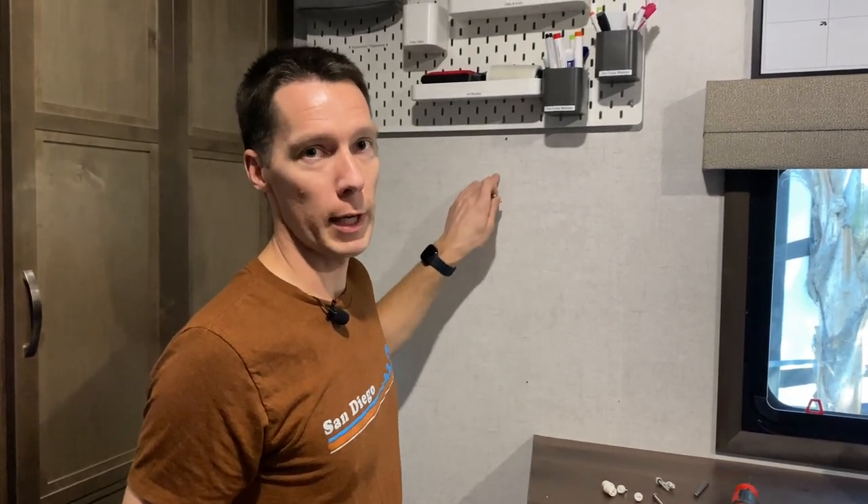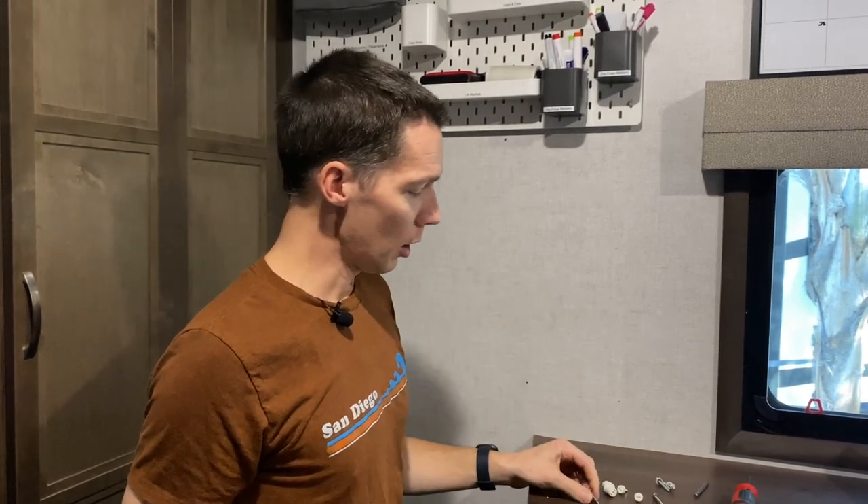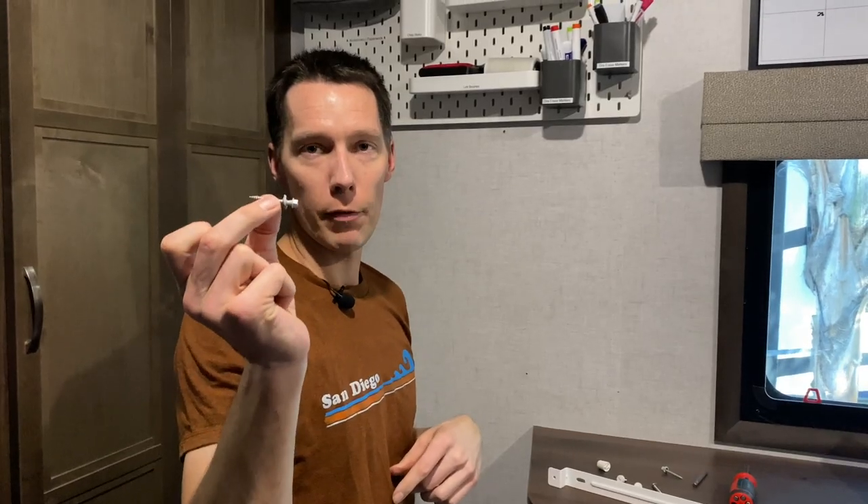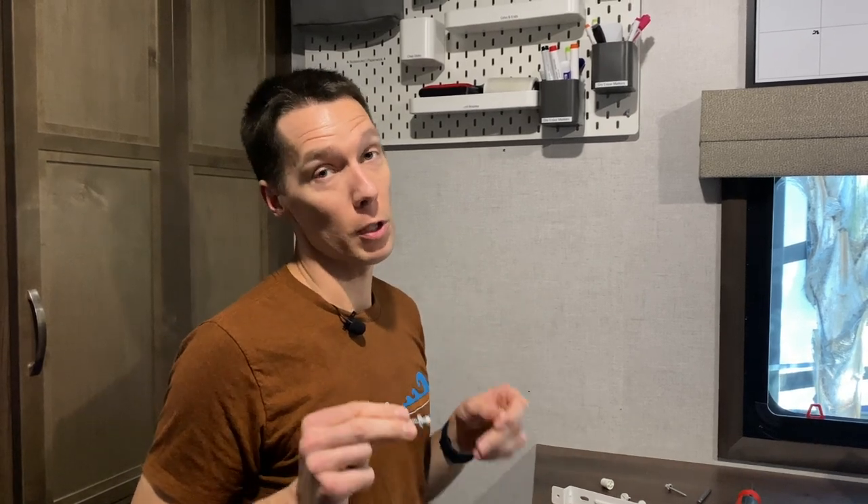When I put them into the wall, I pre-drilled with an eighth-inch drill bit and then screwed the screws into the wall. With the bottom spacers, these normally float against the wall, which works great in a sticks-and-bricks house. But in the RV, I needed extra screws so the boards wouldn't bounce around while traveling. I drilled the center of these spacers out so the screws would fit through the middle. I use pole barn type screws with a little washer head — about an inch and a half long so they don't go through to the outside of the RV. The other screws I use are about an inch and a quarter long. Our walls are around two inches thick. Some RVs have different wall thicknesses, so check how your RV is built. I try to find studs, but most times it's not an option given the spacing and how the RV is built. I use the thicker screws, and after traveling a year and around 12,000 miles, everything has stayed put.